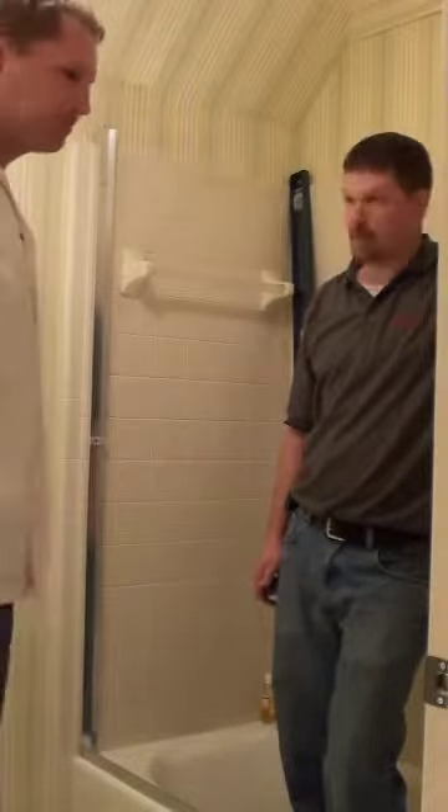He's 6'2" — I can't tell you how many times something like that might be an issue. And I know at my house, my tile stops about right here and I didn't want the header right there. So what we also can do at Cardinal is we can rip a filler that will go on up. If the customer would have wanted the header to stop here, they just need to let us know how far this is and we can put a filler back there so the metal will go all the way back up to the header. That's a possibility if you need to go much further, but once again you get into some custom charges. And that would be a perfect application especially any time you see this large bullnose tile, usually in older houses.